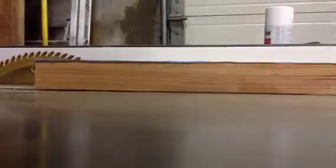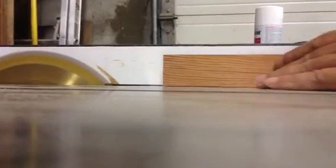Tape will hold all these plugs from falling out while it goes through the table saw. We hope. Let's try it out. I had to go get my safety push stick. Now we take the blue tape, and we put it right up against the fence this way.